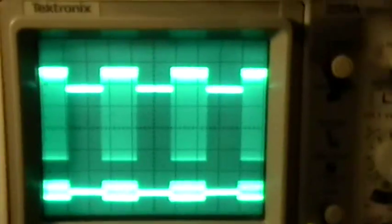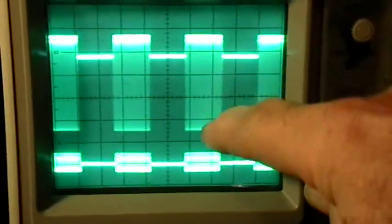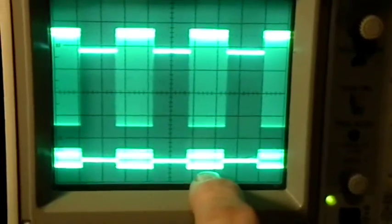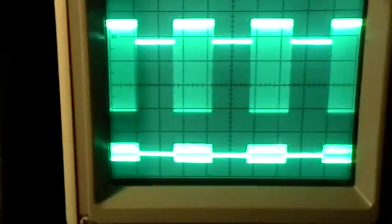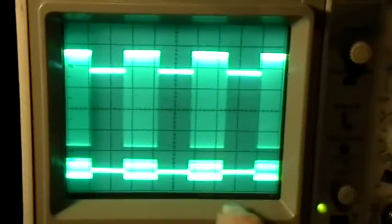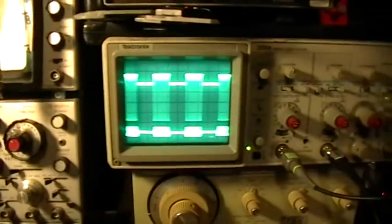Okay. Now I think you can see what this screen is showing you. This screen is showing you that the current sensed by the wire-wound 1-ohm resistor, the concrete resistor, is much, much greater than the current sensed by the non-inductive resistor on my little improvised Kelvin probe. Okay, you see that? And of course the magnitude of that current is determined by the function generator setting. Right? You see that? Both of those traces are displayed at 2 volts per division, indicating the voltage drop across a 1-ohm resistor. Except this resistor is an ordinary power resistor, and this resistor is a special non-inductive resistor.